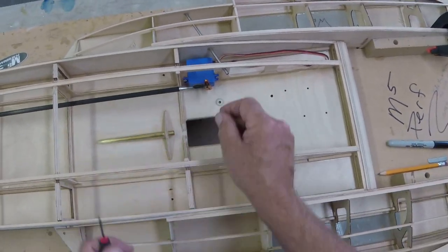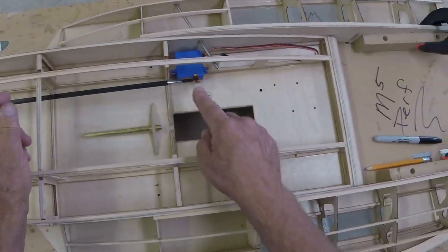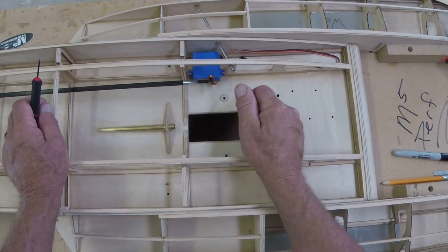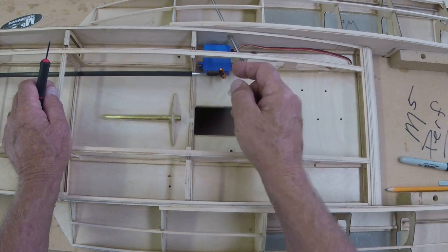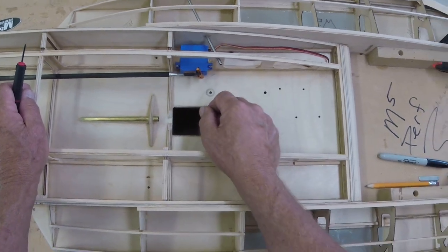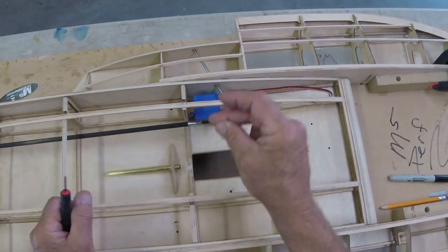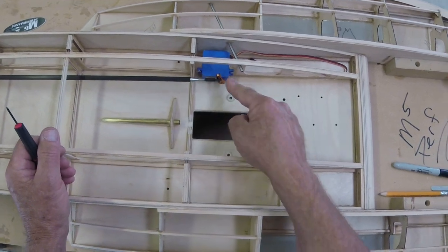Now this one, can you say it's going to take a little bit more beating? Yes, it's directly connected to the rudder. There's no isolation, no movement. You know why I like that? Because I don't want my rudder to be able to move on its own by wiggling a rubber mount. No, solid mount that thing. The tiniest input, the tiniest change in this steering, and this thing will turn right now. So I don't want it doing that on its own, solid mount.